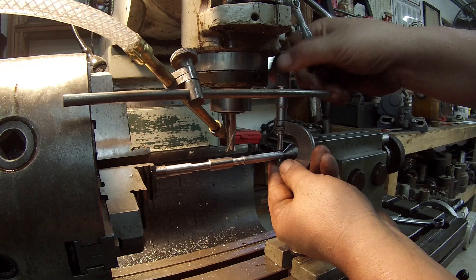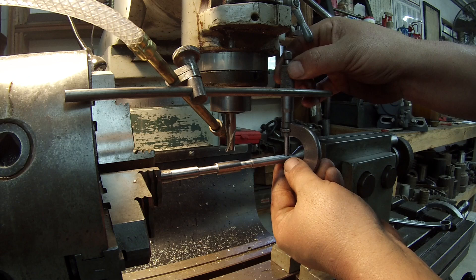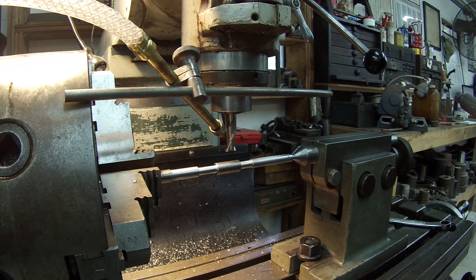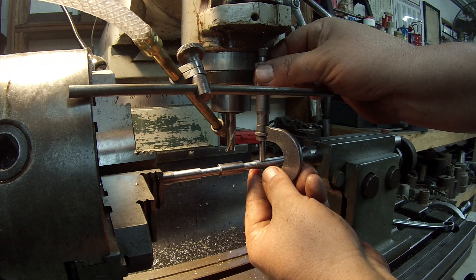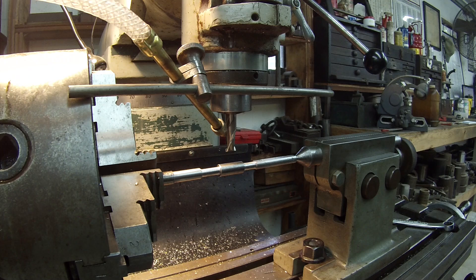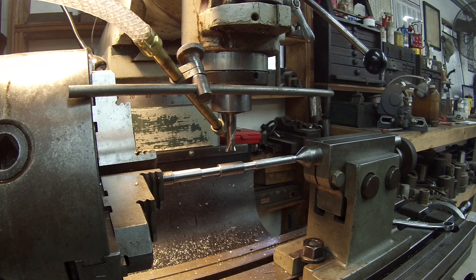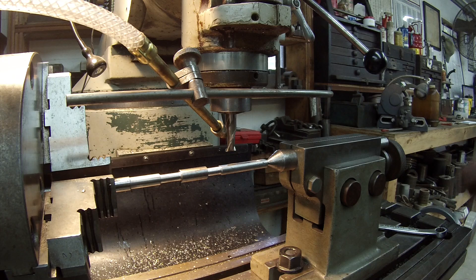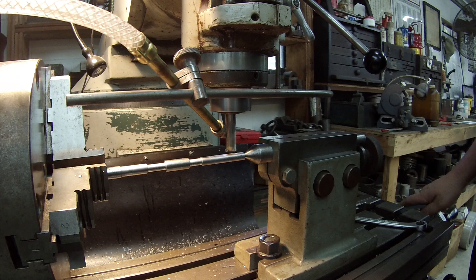Let's see if I can get in here and mic it. I'm at 283 — so about 8 thousandths to go. Right there at 284 — about 6 thousandths. I'm going to go ahead and get it corrected to the right depth and then we'll be able to finish all our cuts. Let me cut these two sides again and we'll come down and cut this. I was finally able to get my sizing where I'm wanting.